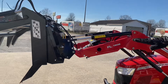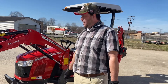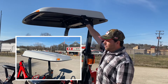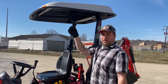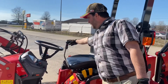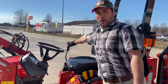We can order you any kind of attachment you want for this tractor, whether it's pallet forks, grapple, bucket — pretty much anything. And you can see this one's got the sun canopy from Agco. It's a flexible ABS plastic material with a reinforced steel frame. It is also adjustable and tilts forward and back. With the grapple, it has a third function kit to actually operate the open and close of the grapple, and that's controlled by this push button and is still operated off the joystick.